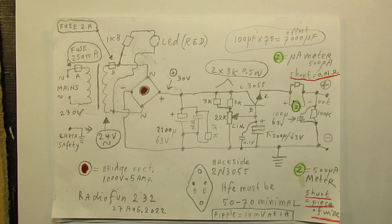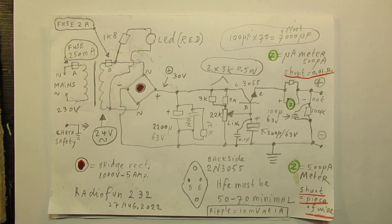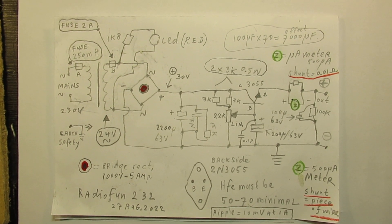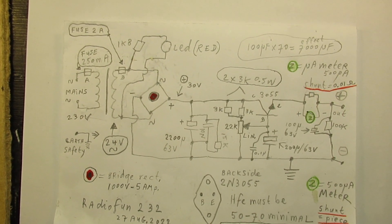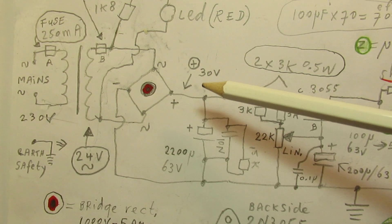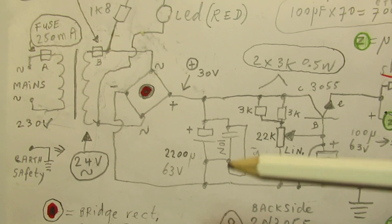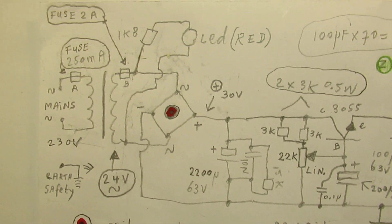This is the schematic. It's very simple. You can use a 24-volt AC transformer that gives out approximately 1 to 1.2 amperes. When you rectify it with a bridge rectifier, the positive output is approximately 30 volts. There is a smoothing capacitor — it's now 2200 microfarad, but 4700 microfarad is better, though it's not a big problem either way.